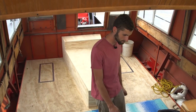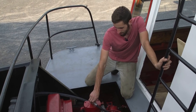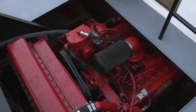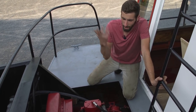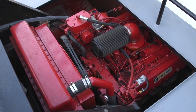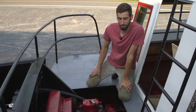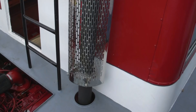This is a basic truck or tractor engine - they're super common. I'm running an air brake system for the front axle, so we've got an air compressor, and we're also running a radiator because this is a closed cooling system since it has to be able to go out of the water. Most boats take water in, but this is standard truck stuff. We painted it red to give it a little more horsepower. The hydraulic system has lines running through with two cylinders coming out to steer, and I'm running environmentally friendly hydraulic fluid just in case there's a leak.